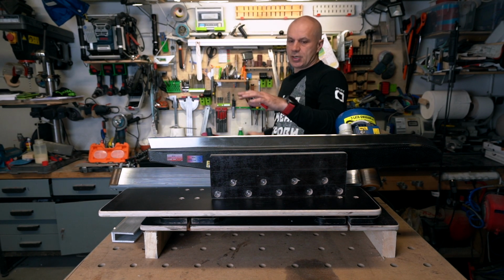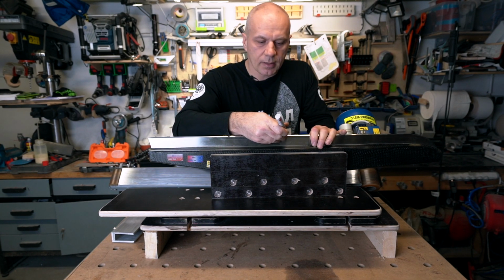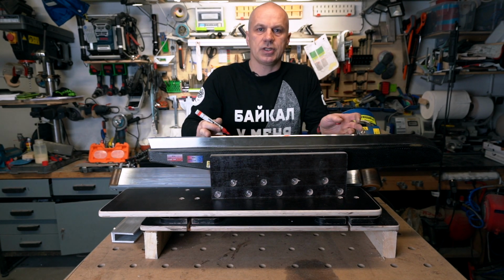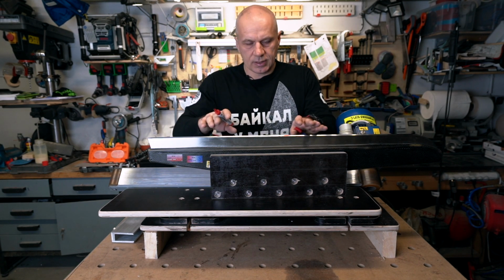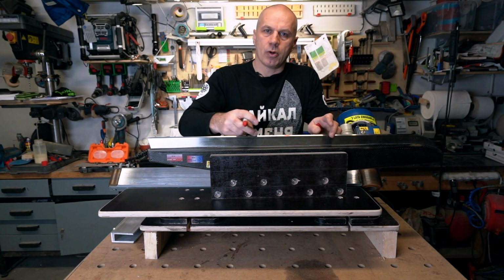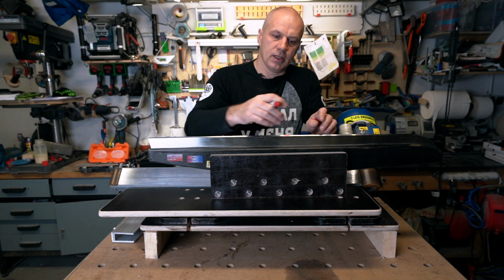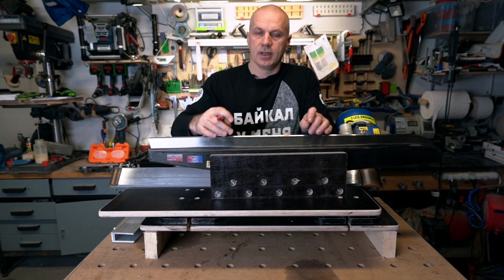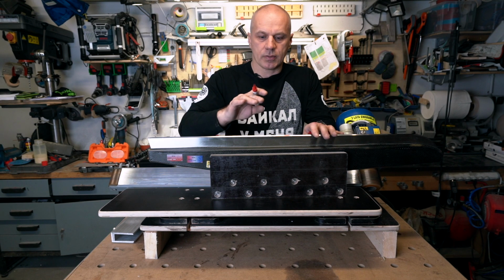And regardless of this measurement, what I would always do in such a case is I will mark my runner's edge at the distance of around 50 centimeters, 20 inches, and I would fully paint it with marker, touch it to a sanding belt just for a second, take it back and check what portion of the surface is removed during this simple check. If the sanding belt removes the whole surface, then it means that you are matching the angle. So machine is matching your runner's angle.